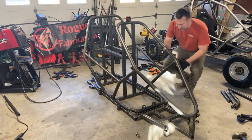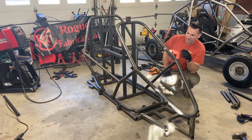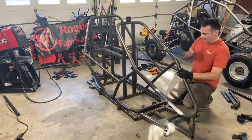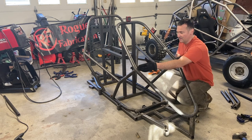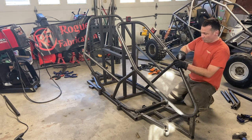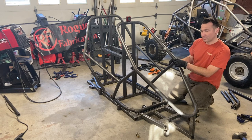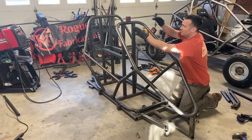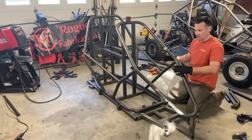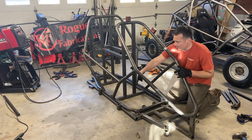To get these A-pillars in place without anyone to hold them — and my magnets wouldn't work because they would rotate out — the picture shows it clearly: this point mounts at the center of this bend, which is a solid reference point. You can see the center of a bend. So I lined up the tube right at that point, mid-bend, and put one small tack on the outside edge so I could still move the tube around and twist it a little bit. That gave me maneuverability to get it level, squared, and find a common point. As this rotates, these are going to choose different points on the side rails, so if this is square and centered, flat and straight, these are going to have the same point on the back because it all lines up.